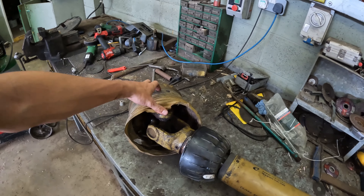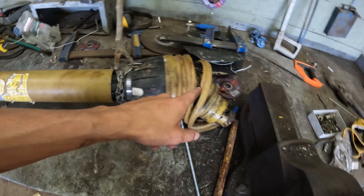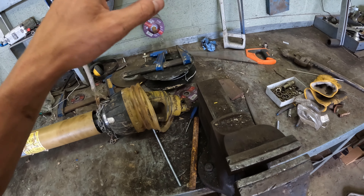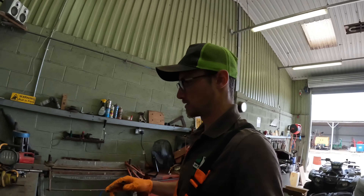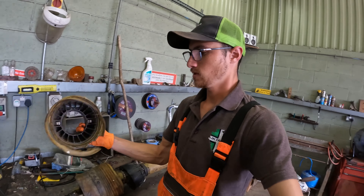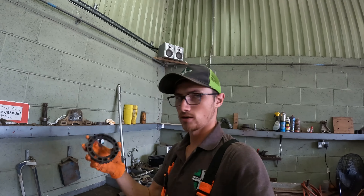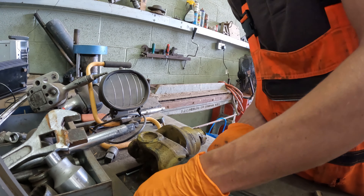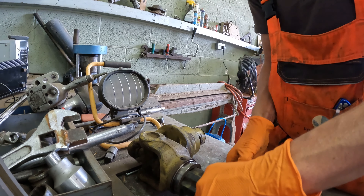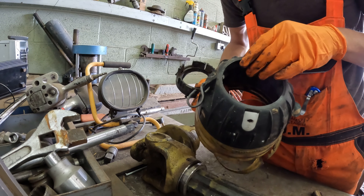This is a really great power shaft - it's a wide angle one so you can have it whilst you're turning. This end goes onto the machine, that's the tractor end. It's got a bracket and two bolts. I've split the shaft, taken the small end out of the big bit and taken the cover off the end - this bit is absolutely mangled. These have a couple of little white clips, you stick a screwdriver in, prise open, and they clip into a PTO ring which normally sits in that groove. But this has all become disfigured - it must have got hot, melted, or something - bits have come out, so it wasn't sitting in there nicely, which is probably why that happened.